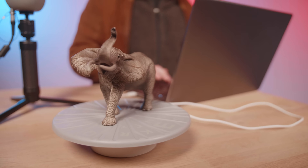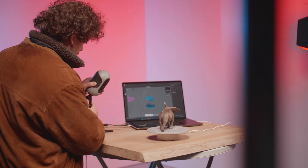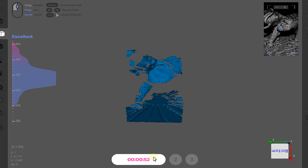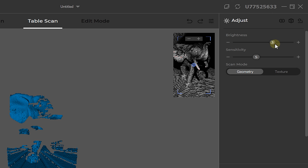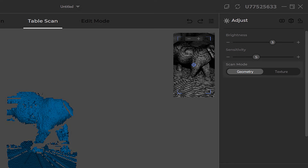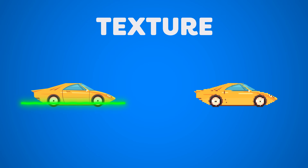I'm going to pick this elephant and place it on top of the turntable. Inside the software, I can press preview and adjust the scanner angle and distance to frame up the object as good as possible. Using the distance meter on the left, we know if we are too far or too close. On the right of the screen, we find settings — the key one is the brightness slider, which you want as high as possible without having this red color on your object indicating it's too bright. There's also the geometry and texture toggle — geometry delivers the best results, while texture will create a texture of your object while scanning. We'll be using both, but first we start with geometry.